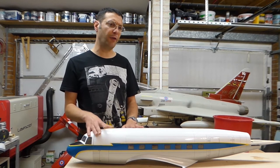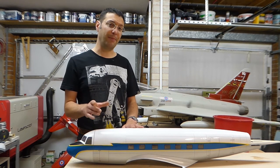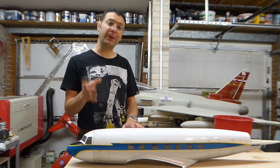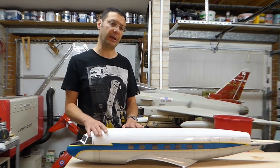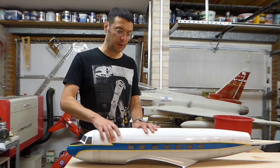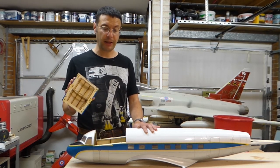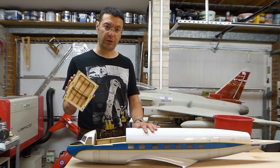It's designed to run from a 3-cell LiPo battery. However, I'm planning to run this on a 4-cell system because I would prefer a little more voltage and less current. So when it comes to the speed controllers, motors and propellers, we're going to have to do our own thing — but not to worry, we'll have more on that later. More good news: there's this large magnetic battery access hatch, and there's ample space in the battery compartment to fit whatever battery we should choose to fly the model.